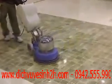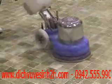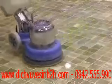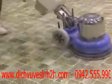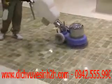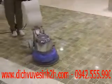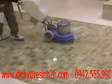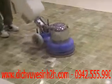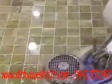As you can see here, the sealer is being applied, and this is a marble crystallizer. So this not only enriches the stone's color, but actually also hardens the stone's surface. And this does a couple of things. It helps the stone to resist stains, but also helps the stone to resist scratches. As you can see here, just working this crystallizer into the stone evenly. And as you'll see in the next few shots, this really brings out the natural color of the stone and the shine also.